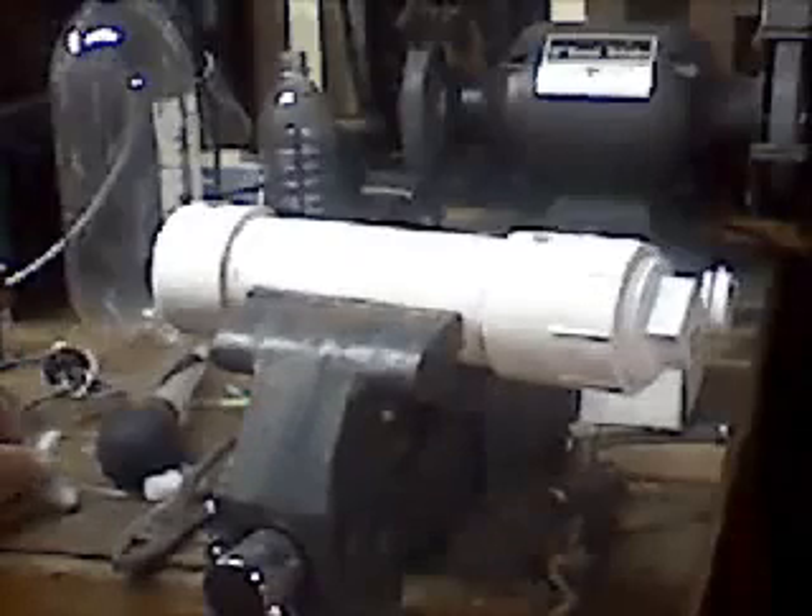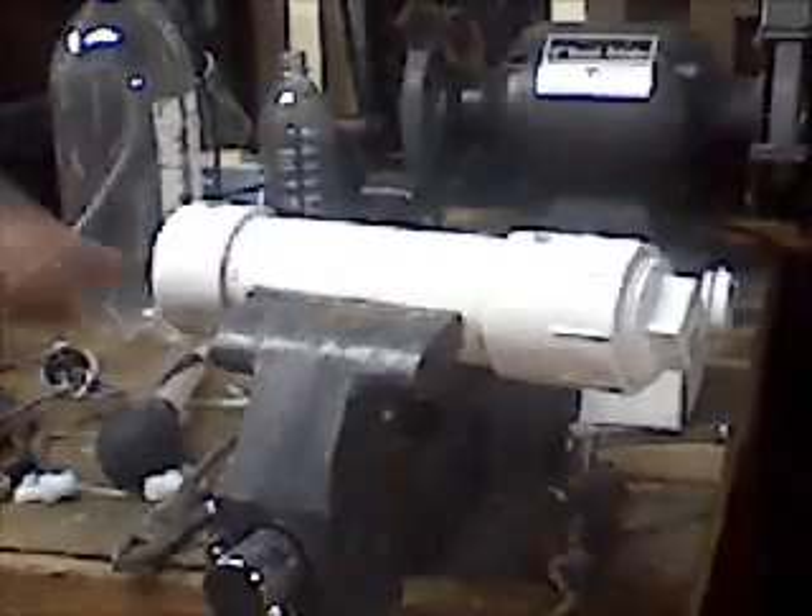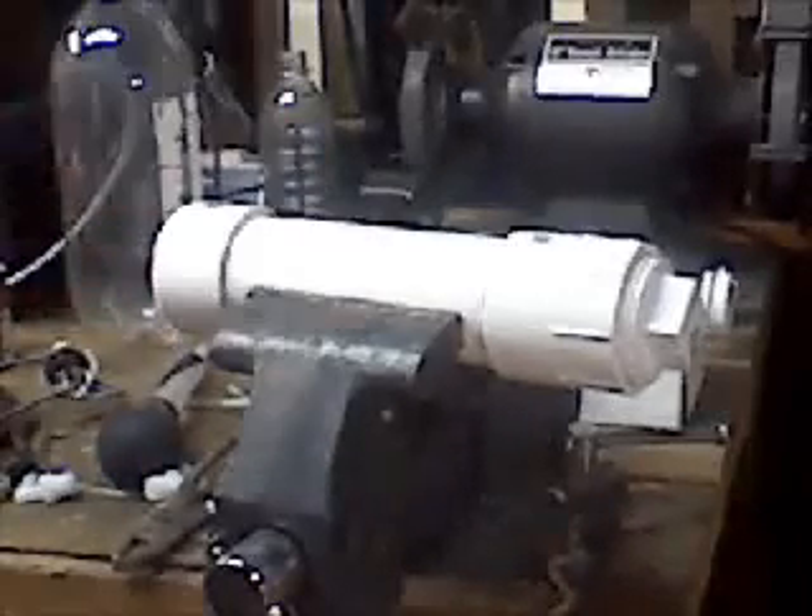This bubbler is a two inch inside diameter PVC tube. The PVC tube section is eight inches long with an end cap on one side and a clean-out cap on the other side. The level inside will probably only be to about here — I have to allow a lot of room for activity inside before it reaches the top, because of how fast the gas is being produced by the electrolyzer cell under vacuum.